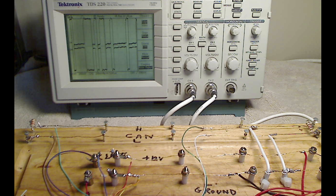You'll also notice that on each end of the CAN bus there is a 120-ohm termination resistor — we'll talk more about that later on. There is also a 12-volt DC bus which originates from the power supply in the soldering station, and there is a K line. You need to set the time base speed, the trigger level, and the two inputs to the correct sensitivity setting.